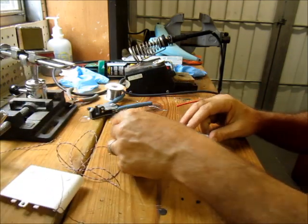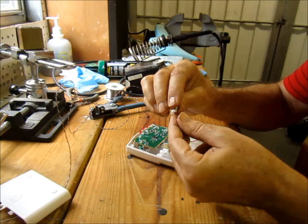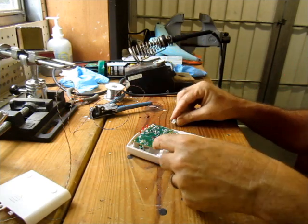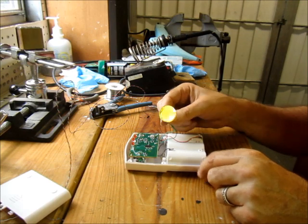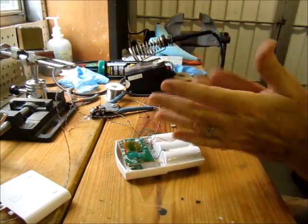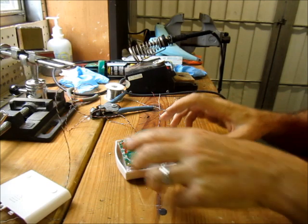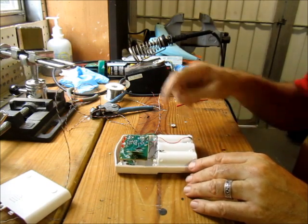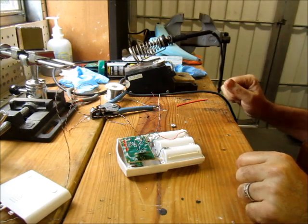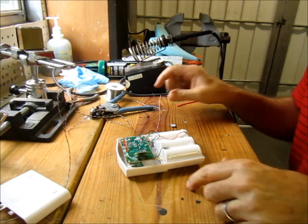What I want to do is remove one of these LEDs, put it on a piece of wire so it can be used further away, and the same thing for the speaker. I'm also going to put in a little volume control knob — just a resistor that I can vary. For sound-activated props, you'd have this on the wire and tape a piece over its audio receiver where it picks up sound when you clap. The low chime sound will cause it to go off whenever someone walks into the vicinity. Same thing with light-detecting props: take one of these LEDs, tape it over the sensor, and whenever someone walks in front of wherever you've placed the wireless PIR sender, it will cause your prop to go off.